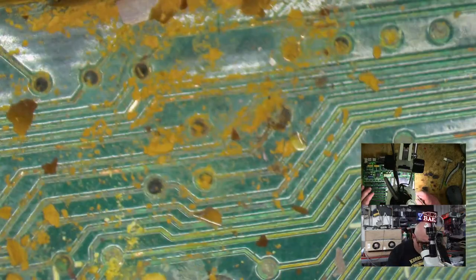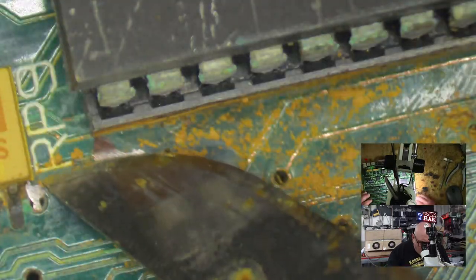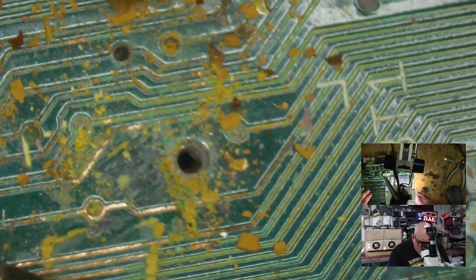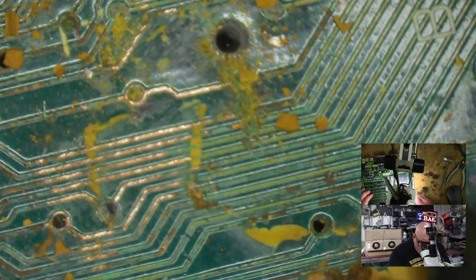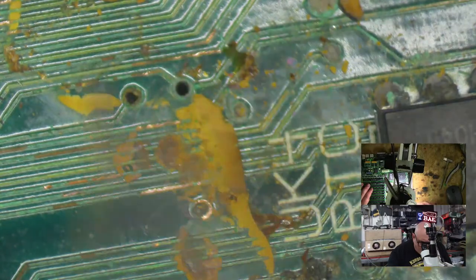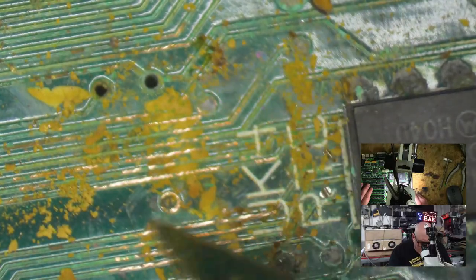Okay, alrighty. I'm getting the feeling that it would be prudent for me to remove this chip, because if there are any traces running underneath it, and there are, going to the PDS slot, they're probably going to be stuffed. Look at those holes, man. What I happen to know about these is that these holes are vias, and those vias, if they're the ones I think they are, connect to the ROM slot on the inside of the board. So we're probably going to have little traces running on the underside of the board, which is a bit of a poop.